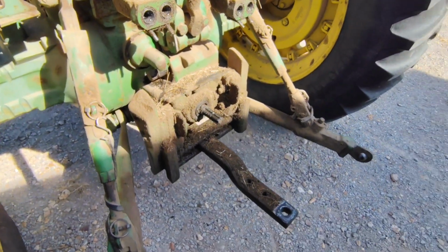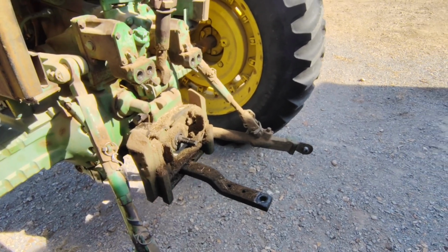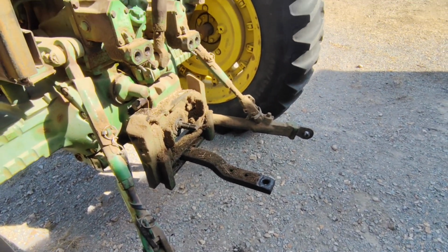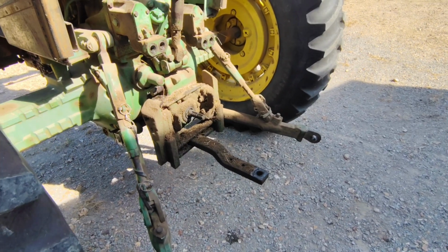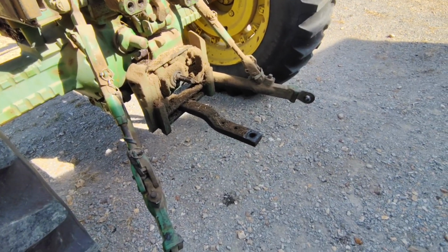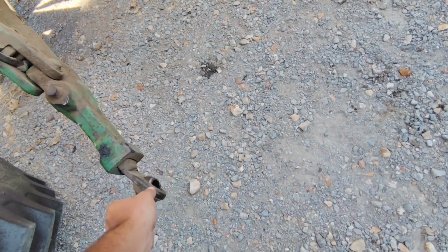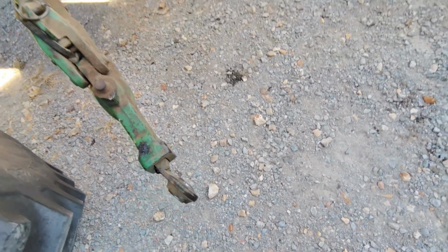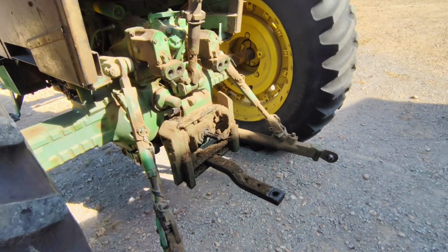And if we look at the rear end, this is actually category 3, 3-point hitch. It's called a 3 narrow because it will go down to category 2 specs, but it has to be bushinged. They're category 3 pin size. And when I pull my disc mower with it, I have to bush it down to category 2.